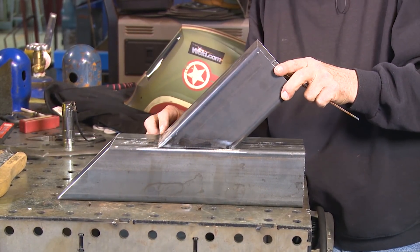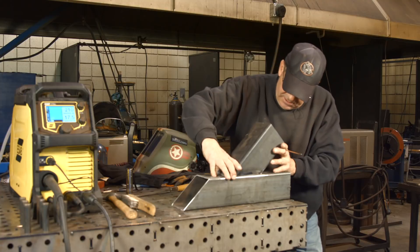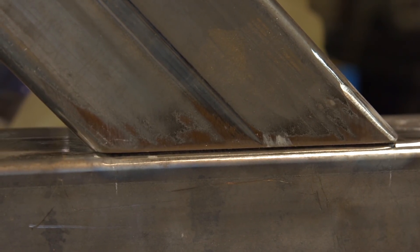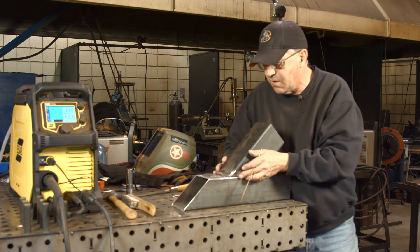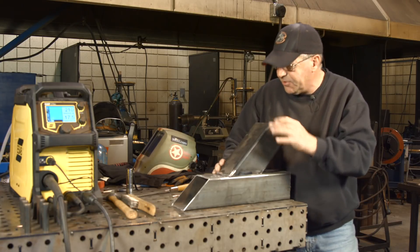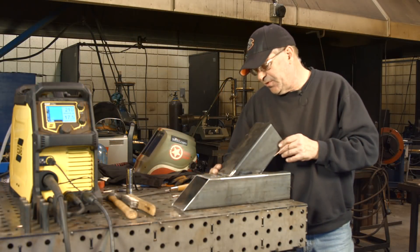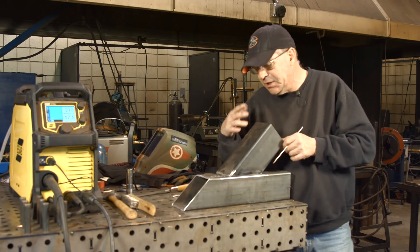For workmanship, I've gone ahead and cut the hole in this, and I've skinned the mill scale off of the weld area. I've cut this opening for feeding the fire — there's a little radius here — and I've cut a chamfer back because all these welds are going to be small. We're talking eighth inch material with gas metal arc welding, though you could also TIG weld this. We're running off the ESAB Rebel 215 at about 17.5 volts, 210–215 wire feed speed, 40% inductance for a soft weld, 75/25 gas, .030 ER70S6 wire.